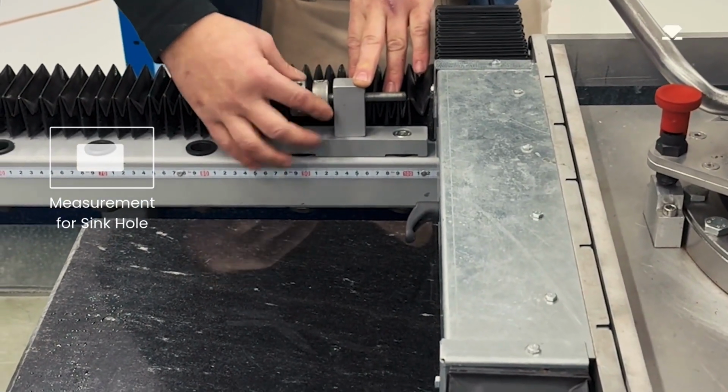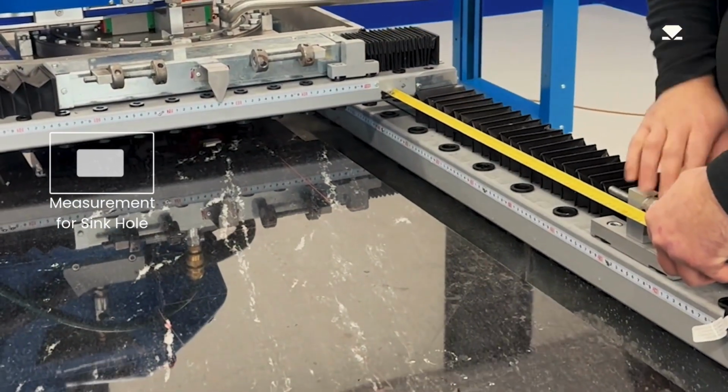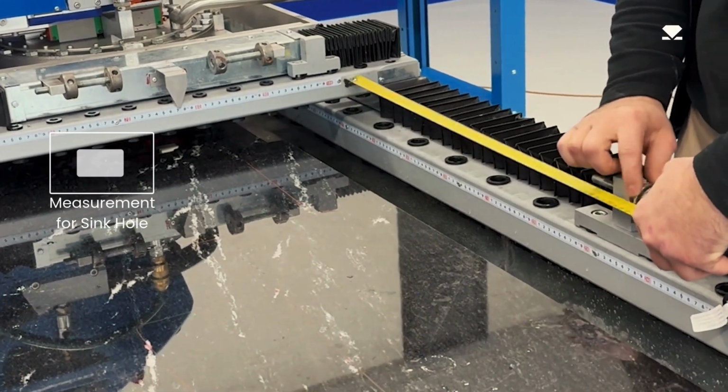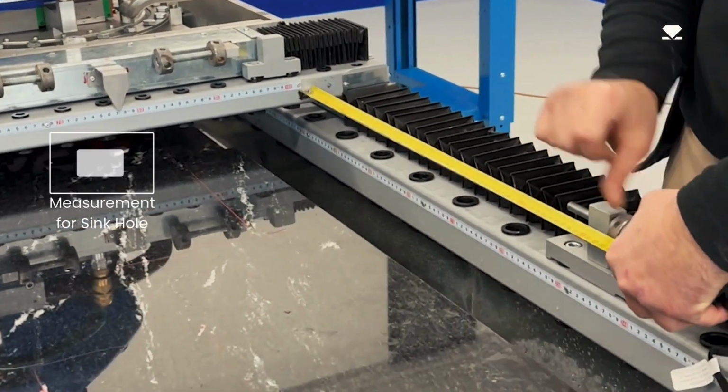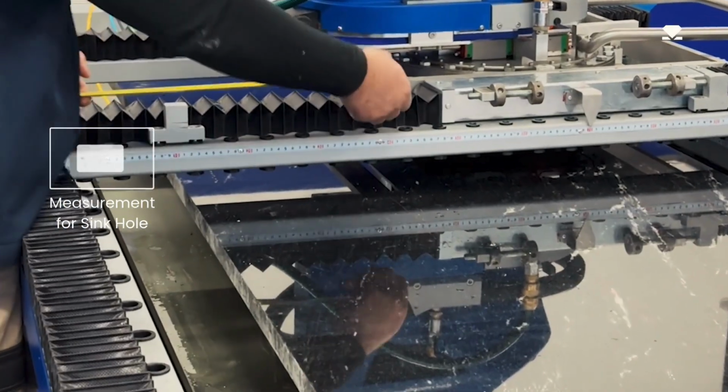Finally, a second stop is positioned on the long axis to define the cutout length, applying the same procedure to the short side to determine the depth, ensuring the space between the adjustable and fixed stops matches the desired measurement.